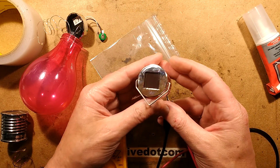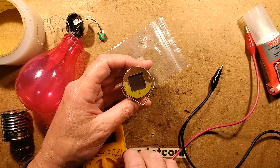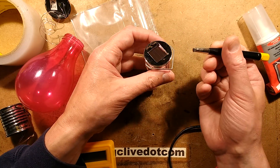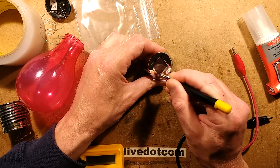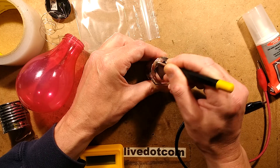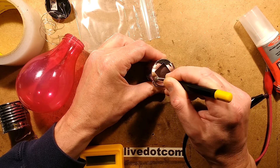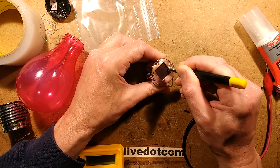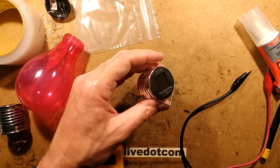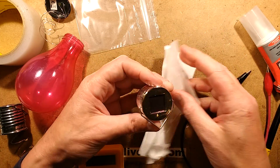So what I'm going to try to do now is rough this surface up. I'm going to apply silicon in a new and interesting way that I've just come up with, and then we'll see how it measures once I've got the silicon on. I'm going to use this braiding pen, which is a steel fibre one, to basically scratch the plastic around here to see if I can get the silicon to stick into it. So I'm just scuffing that up a bit, and then I'll rub it with a cloth. I should really degrease it — some acetone would have been quite good for that — but let's just rub it briskly with a bit of paper towel.